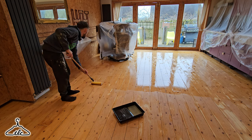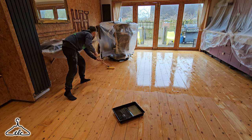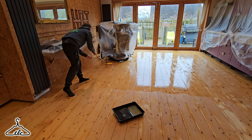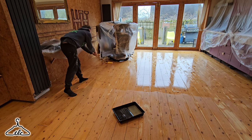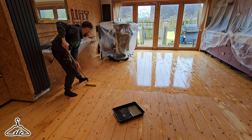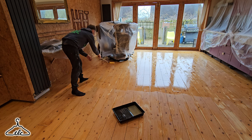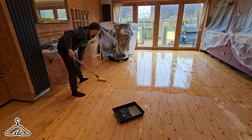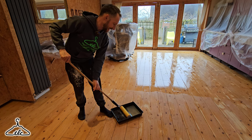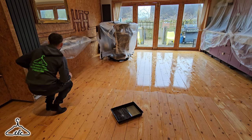On a job like this, preparation is probably the longest part. Sanding it back took me about five hours in total, and I'm starting to get a little bit bored. If the lacquer hadn't been peeling and it was just a recondition — a quick blitz with the sander — maybe an hour and a half. But because I was going over all those loose bits of lacquer, that's where all the time went. If I didn't do that properly, it would have just looked like a dog's dinner.